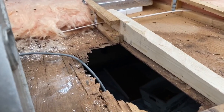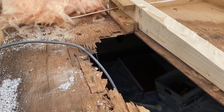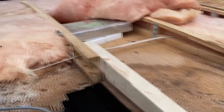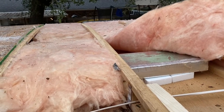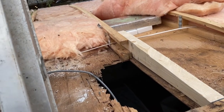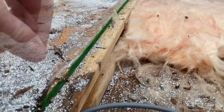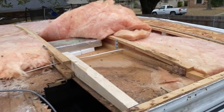Let's go ahead and get a sheet of plywood up here. I'm going to put some construction adhesive down on these trusses, then set it in place. I'll dry fit it first to make sure everything fits okay, then throw some adhesive on the boards and get that fixed. I didn't go with OSB — I couldn't find any true 3/8 OSB in stock anywhere, and I didn't want the height difference to cause issues with water pooling, so I found some 3/8 plywood to work with.